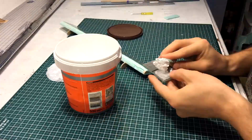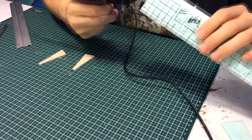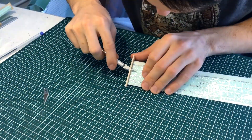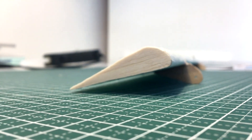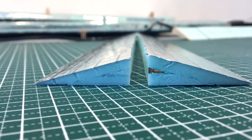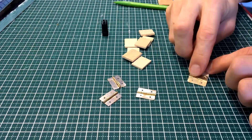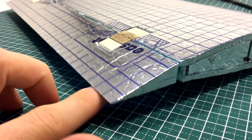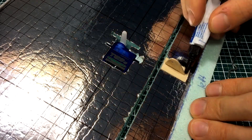After giving the flap a good sanding I covered the entire surface with a white filler material. After that I sanded it once more and attached balsa wood end caps to either end of the flap. Now I started working on the ailerons, which have a much simpler geometry and will be attached using simple hinges salvaged from an old airplane. I sanded their surface so I can attach them to wood using super glue. Finally, using small wooden pieces, I created a small arm to which the servo can attach.